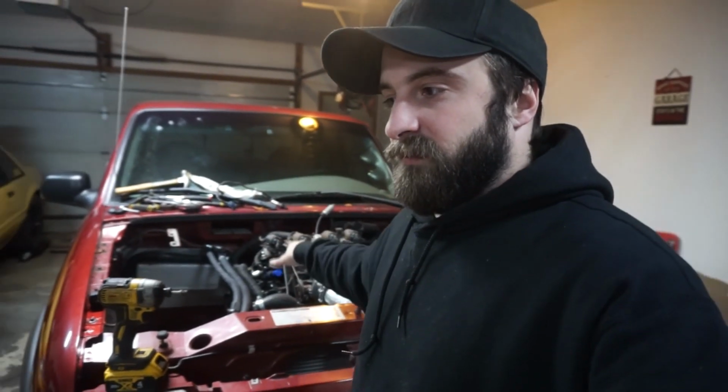I think that's fuel in there, because when I took the 210s out of the truck like 3 months ago, I put them in the car for a little bit, and I made one fuel change. I changed the flow rate, and then I made one other correction to it just to get it close, with the intent to go back later and change it, and then I just never did that. And I've been driving it to work for like 3 months at like a 12.5 air fuel ratio, like 12.5 to 13 all the time. So probably a little bit rich, well, very rich, especially with E85, because I was running E85 in it for a long time. So I think that's fuel in there.